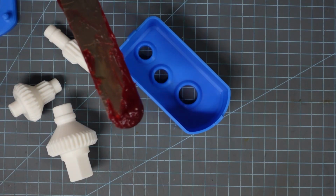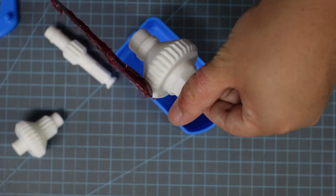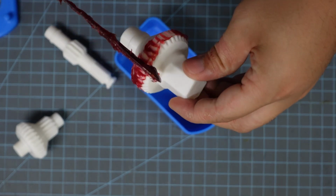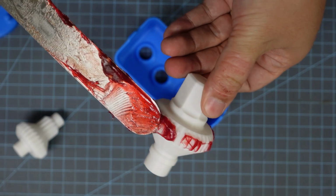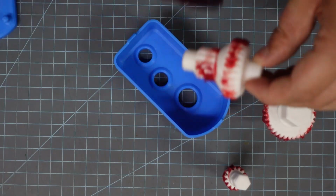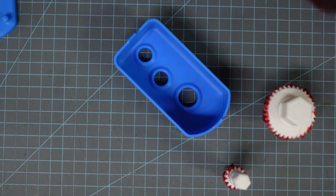I've never had huge trouble with the gears needing grease unless I print with ABS, but since we're going to seal up this gearbox forever, I think it's a good idea to apply some grease so we can be healthy in the long run. There's almost no such thing as too much grease for your gears, so I just loaded it up really rich.